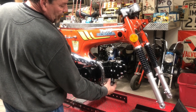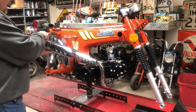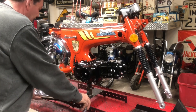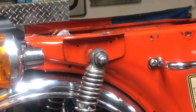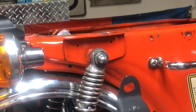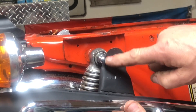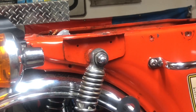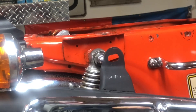And so when you put the exhaust in, we don't line up back here. Let me grab you guys so you can get a little bit better look. Hang on just a second. All right, now I've got you zoomed in. Let me put the exhaust back up in the front, and you can see the slotted hole that they have in here won't reach the mounting bolt right there.